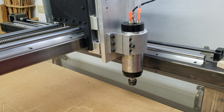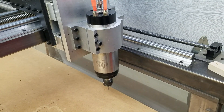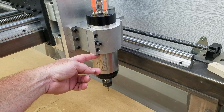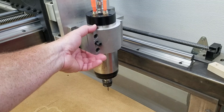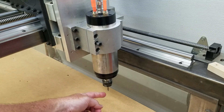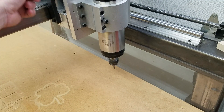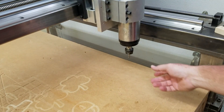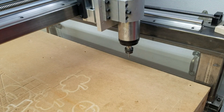The other thing we're going to do to improve rigidity is reduce the amount of reach. The further up inside the holder I can get this spindle, the better. That in turn means strictly less reach. I would say that's a very rigid connection right there, but it's the leverage exerted by mechanical advantage between down here and the bearings. This distance from here up to this first bearing is a long reach.